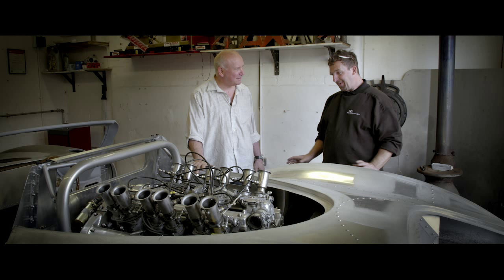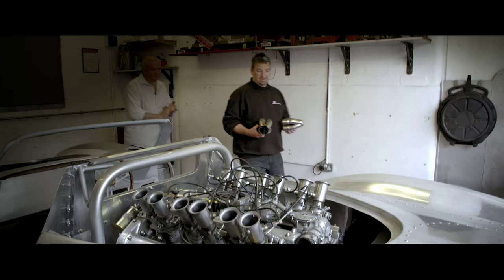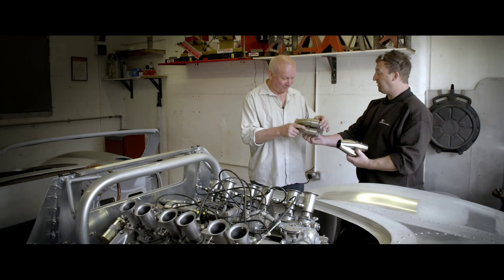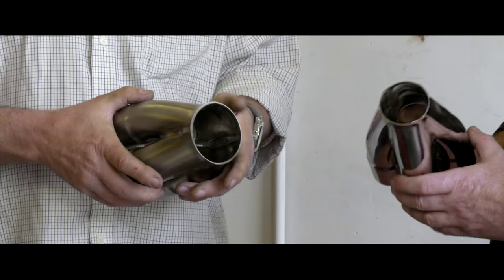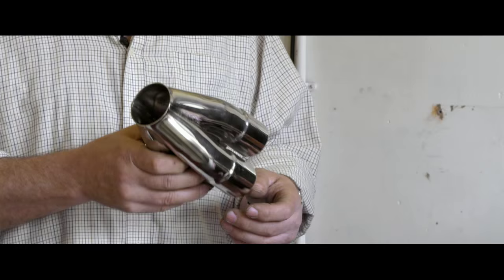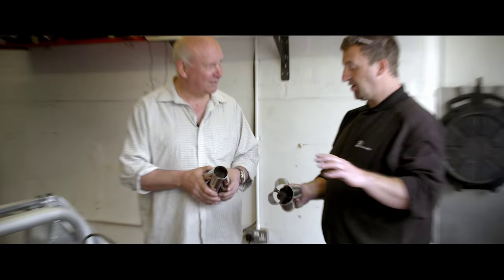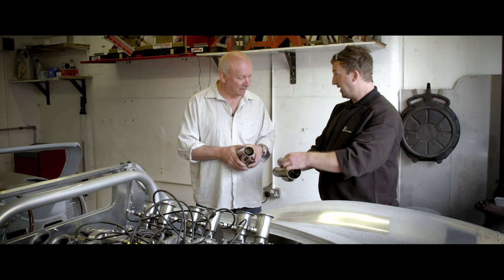That's something I can decide a little bit later — we'll build from there. Because the original was just a prototype, I'm not looking for anything that's too fancy or shiny. The original was steel — Mick McGallagher installed the original system. He said they formed it from steel: big steel pipes filled full of sand, plugged at both ends, heated and then bent. Quite often he'd have slightly damp sand and the thing would go off like a rocket! So that's what we call mill finish — that is as it comes. That is beautiful in its own right, actually a work of art. I would prefer people to be able to see the quality of the welds as they could on the original. And once it gets heat in it and it colours, the material will actually go that colour as well — I think it looks really nice. Sorted — I can't wait.